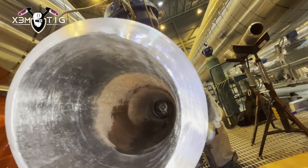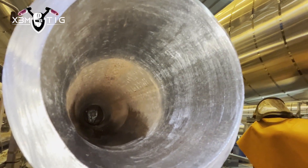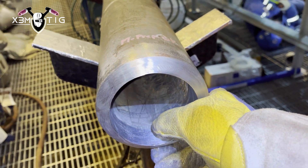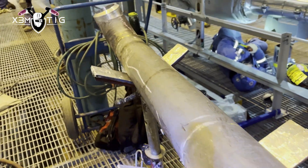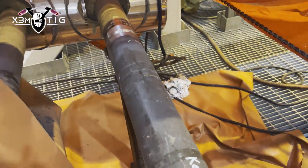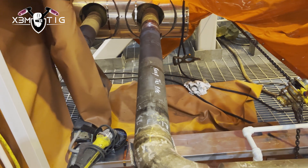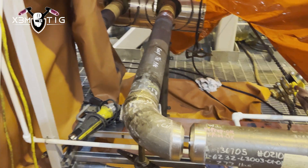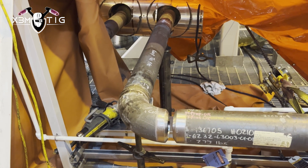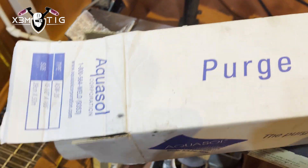There's still some water here from the steam blow - I'm gonna hit it with a tiger torch and sweat it out. One little tip before you put any dam inside: always do a dry fit. Make sure your pipe fits perfectly just like you're about to tack. If you put the dam in and then have to grind or open up the fit, you'll spray inside the dam and burn it - it won't work.